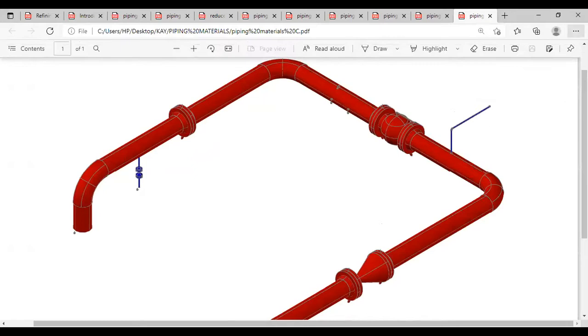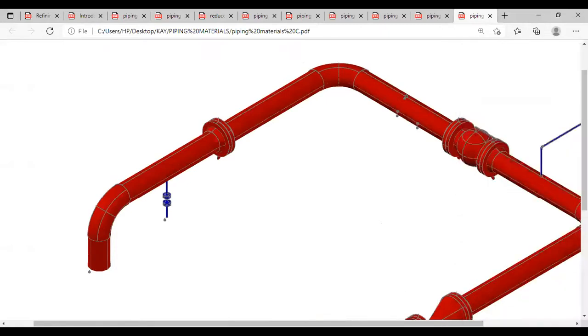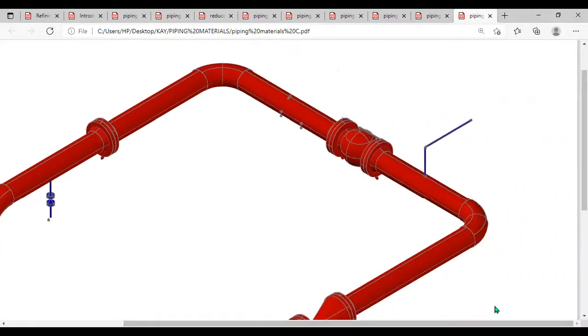Okay, in this diagram over here, this was actually a 10-inch line. This is a 10-inch line now. So they now introduce a sockolet, an olet. They wanted to attach a pipe, a line of 1 inch. So like I said, you can't get that kind of reducing tee readily in the market. It's going to be by special order, but you can easily get an olet. So a sockolet was used here as a means of attachment.